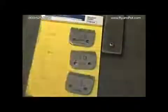Now keep in mind, this is under a controlled situation where we didn't have dirty blades. We didn't have blades that had been used. We didn't have blades that had rust damage to them. So these were just regular blades, 10 blades that we ran, and every time you sharpen a blade, you would run it back and forth on our wheels about 10 to 15 times. And so we kept track how many times we did that.